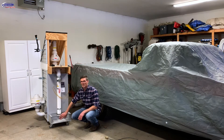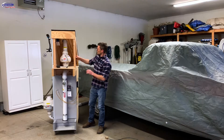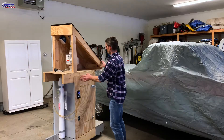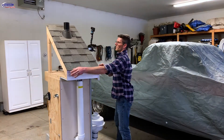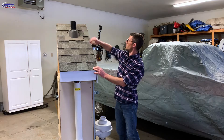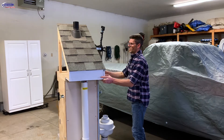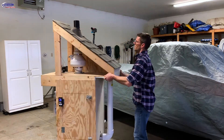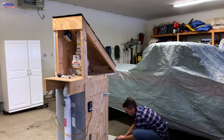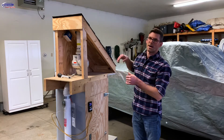Here we've got our suction point down here. This three-inch pipe goes up, and this is supposed to simulate the attic, with the fan in the attic. We've got an RP-145 radon fan from Radonaway here. And turned this way, this would be simulating the roof — so we've got the shingles and our pipe coming out of the top. Right now I don't have anything on the top; it's just an open three-inch pipe. We're going to plug this in and check what kind of airflow we get and, more importantly, where that air is going when we have an open cap.